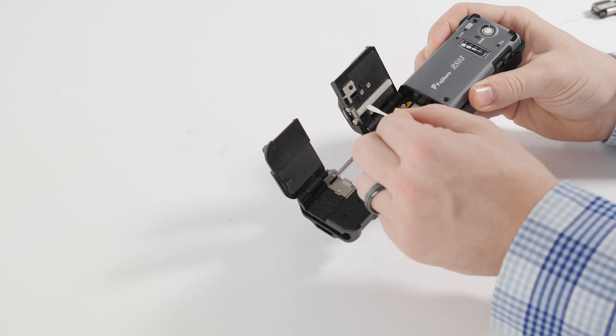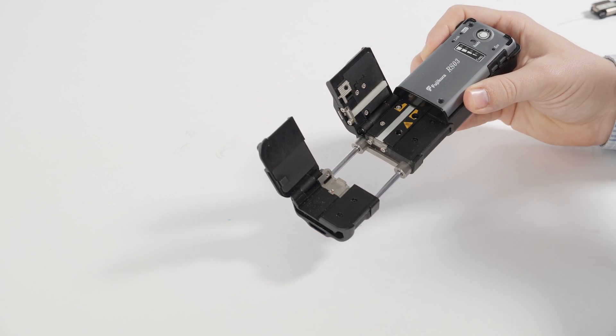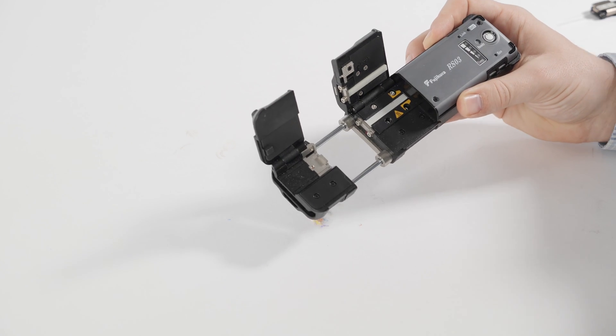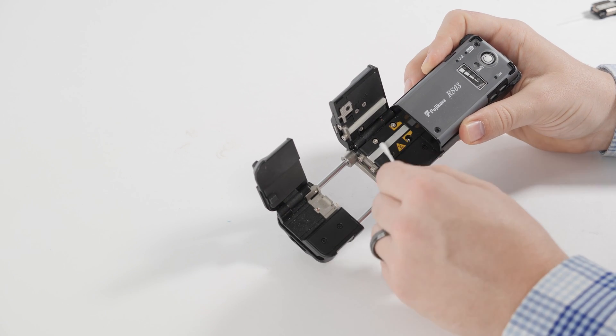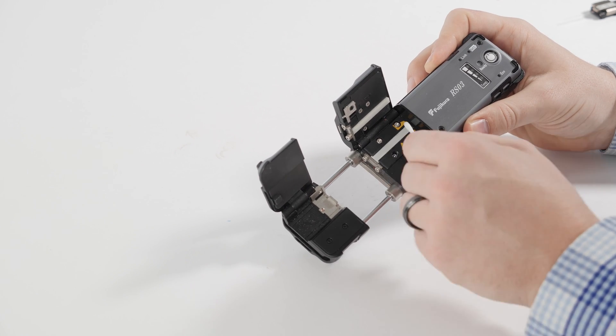After this, wipe away any remaining debris with your brush or an air source. If you are stripping web-type ribbons such as AFL spiderweb ribbon, or if you are ribbonizing loose tube fibers, you will need to follow this process after each strip.